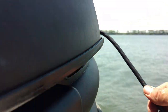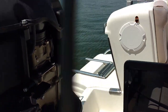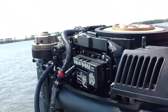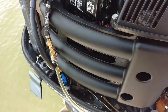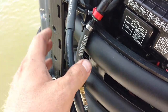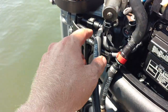I've got my MEDS Marine Engine Diagnostics software made by CDI Electronics hooked up. I'm going to use it to remotely actuate the fuel pump and see what we've got going on once we can get some fuel into the VST. I also have our fuel systems testing equipment hooked up — OST FST 001. This is our quick connect testing equipment so that you can connect up to fuel systems that have no Schrader fittings whatsoever — just quick connects.